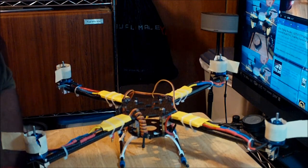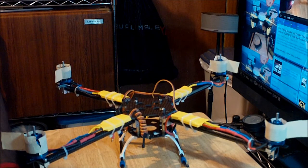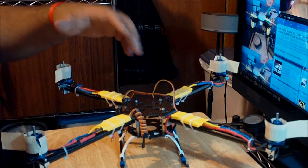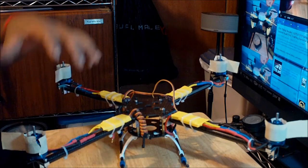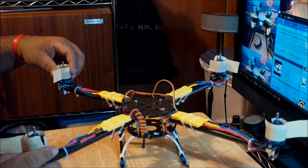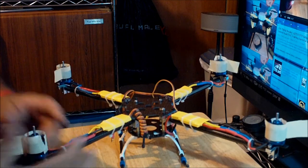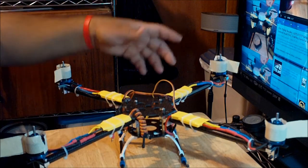This is the end of video number four. The next video will be video number five, where I'm going to install the receiver and the gyro controller into the quadcopter, plug everything in with the battery, and make sure the servo reversing on my radio is set up correctly. If you used tape to set up the ESCs and find out motor spin direction, don't remove it — you're going to need it for the next video.